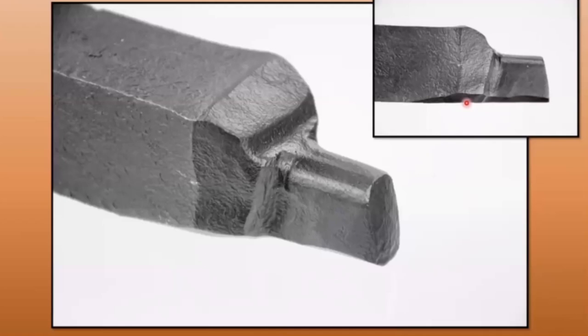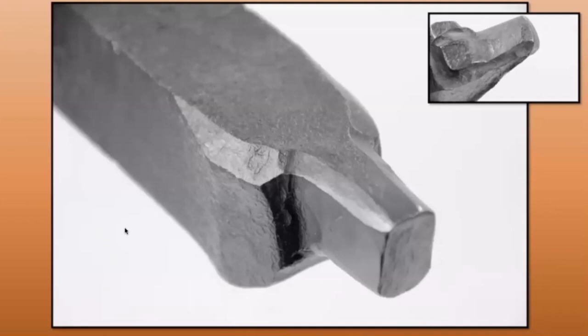So now let's have a look at the underside of the jaw, which is going to become this bear's beard. And this 45 degrees, or whatever we got, is going to go a long way to make that easier. So this is what we're going to try and do. We're going to rest a fuller on here, and we're going to shape this later on into making the beard.